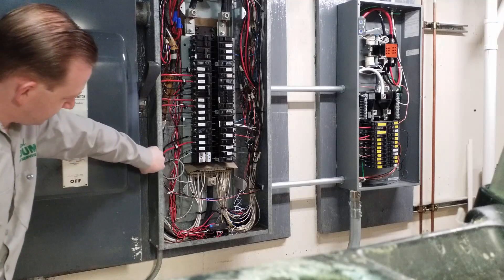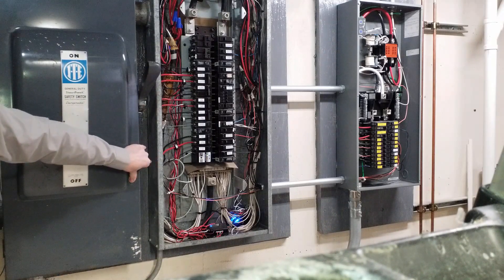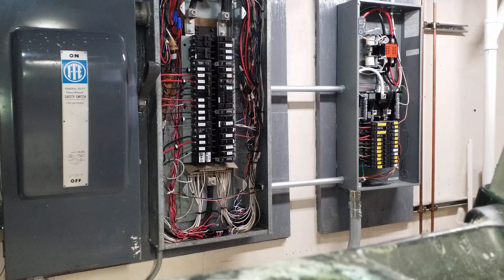The way this was set up is in this main disconnect, we've taken from the fuses and routed 200-amp conductors — I don't know the exact size off the top of my head because I'm not an electrician — over to here, over to the transfer switch panel. What happens then is when the main incoming power is disconnected, there's a solenoid, a voltage-sensing circuit up in the top section of that emergency panel that'll sense that and flip over to generator power.